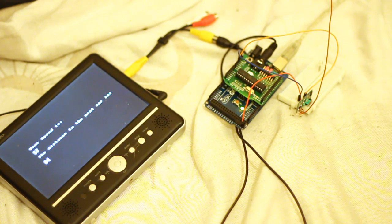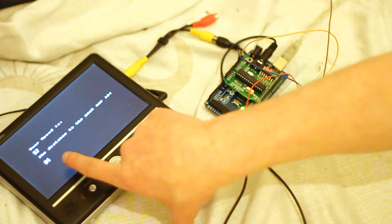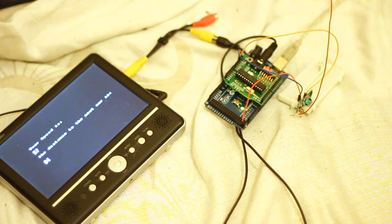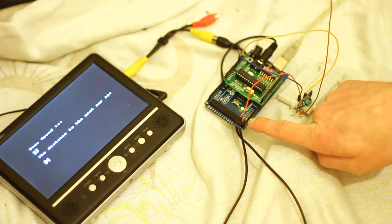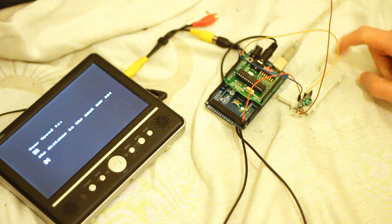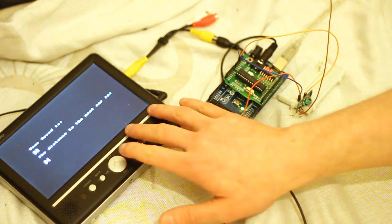It's using a wireless potentiometer to just send a fake value, but it needs a bit of smoothing, it seems, because it's sort of oscillating around. So perhaps a resistor might do that for me. The distance to the next car is 0.4, and that's actually centimeters according to the ultrasonic sensor. You can see here that it's connected to 5 volt and ground, and it's diving into one of the digital pins there to get the information through. I did have it set up on an LED just so I could see that it was all received, but in the end this has worked out quite well.